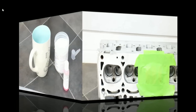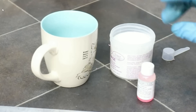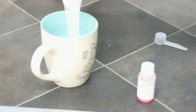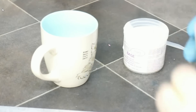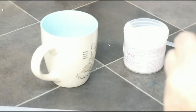So that's the next move — mix the molding material. I find it's best to mix molding compounds in a china cup like this, because the glass coating means this won't stick to it, so it's easy to clean after. It's going to take about three quarters of one of these. Just a little bit more — there we go. We will stir that.